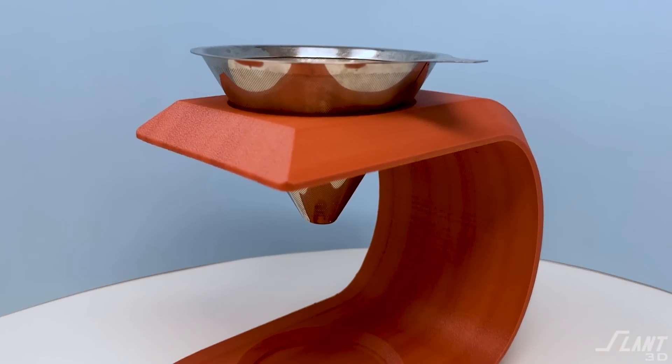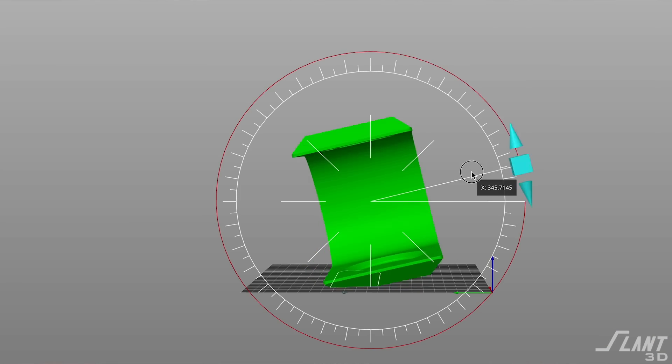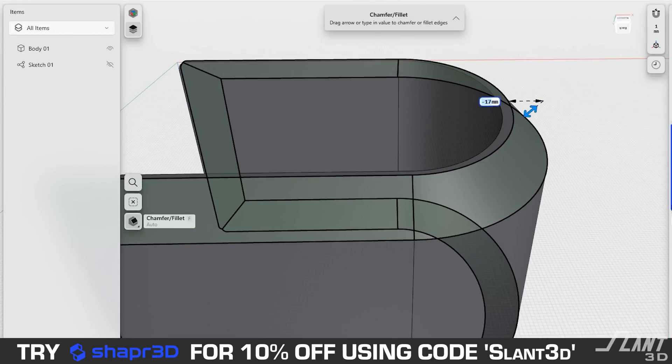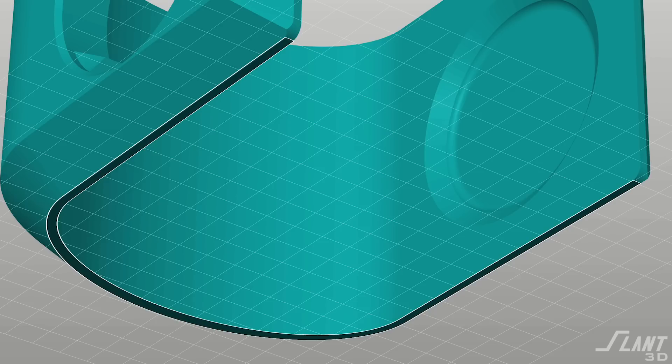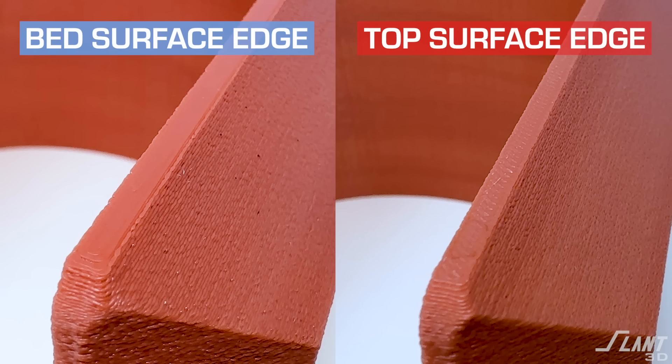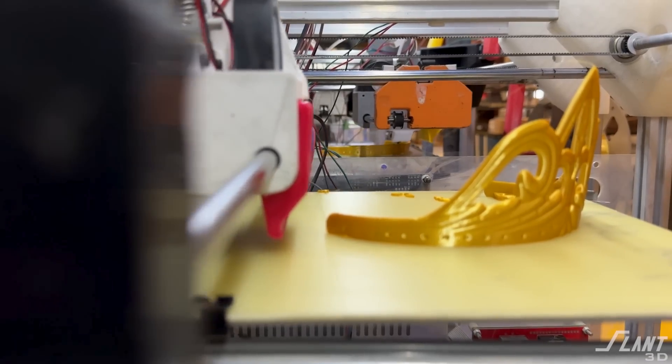When we designed it, we wanted to make sure it was strong and reliable and didn't have any supports. A lot of times you'll see us say to print it at an angle so you don't need support, but that doesn't really work here because we wanted this rounded outer shell and this beautiful texture. So we had to print it on its side. When printing a part on its side, it's important to be aware of the bed surface. This part was designed to have a sharp, chamfered edge that comes down to almost a 1/8-inch wide seam. This means the bed surface doesn't really impact the look of the part, because the bed interface spot is so small. That minimal bed contact area also allows this fairly large part to be mass-producible because it doesn't require manual removal — the machines are able to eject it and move on. So you have a lot more scale with this part to where it can be produced affordably.